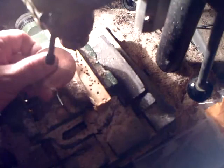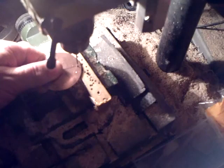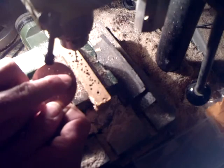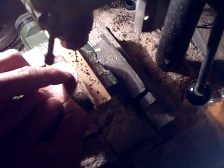Now drilling the holes — pre-drilling them actually with 1.5mm diameter. Copper is quite soft, comes quite easy. The drill bit snapped off — I didn't watch out. It got stuck in there. This sometimes happens with these cheap drill bits. It's stuck in there — I could pull it out with pliers because it's protruding.